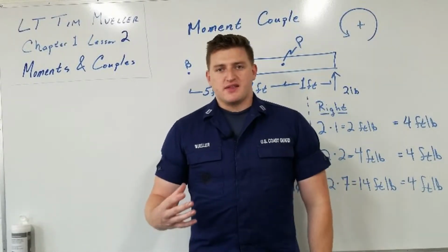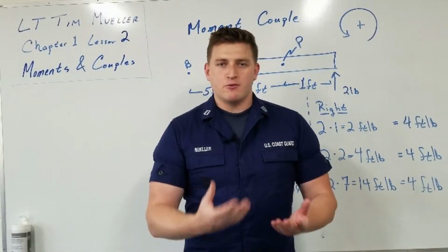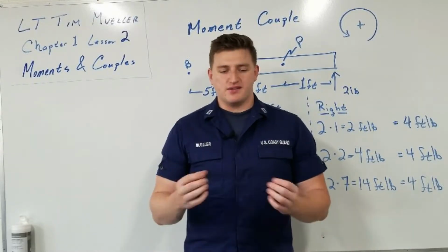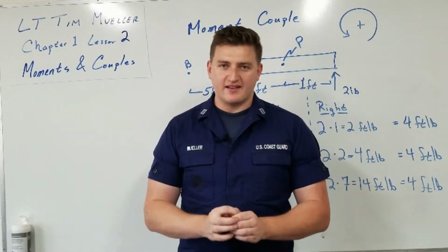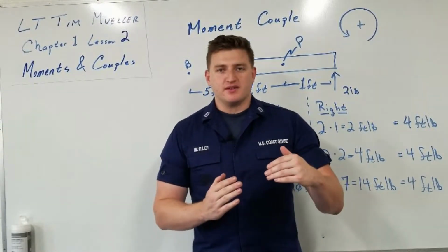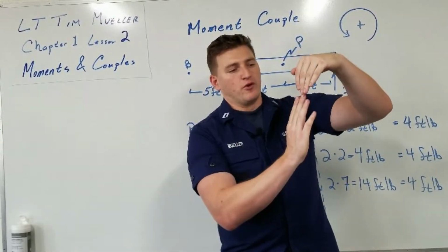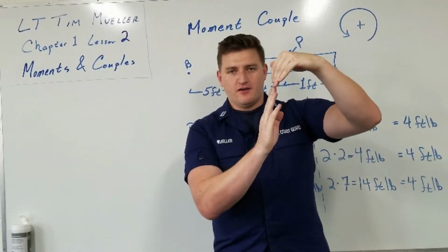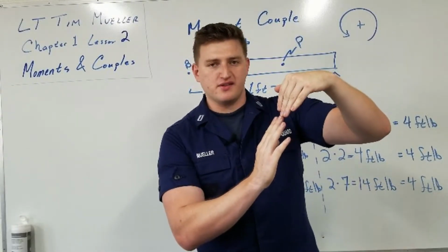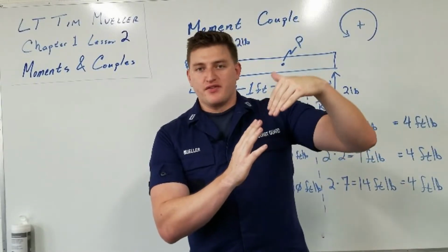Archimedes' principle states that the buoyancy force is equal and opposite to the force of gravity. So we have a center of buoyancy through which that force of buoyancy acts, that is equal and opposite to the force of gravity. So we'll be having a force of gravity down and a force of buoyancy up. If these are directly along parallel lines with no distance in between them, then there's no net force, which means that nothing's going to move.